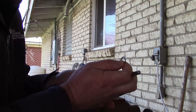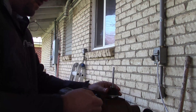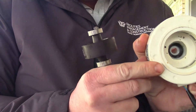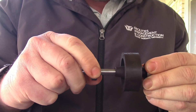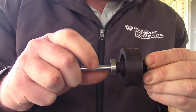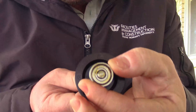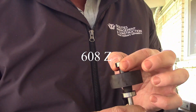It just falls apart in your hand. This is going to be very repairable. The motor itself — all the windings and everything are just completely sealed in here. What's nice is they're not pressed on. Everything just slides right in. It'll be an easy repair. This is so doable. We just have to look up these numbers online and see where we can source these bearings from.